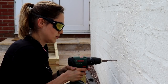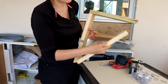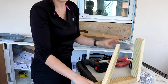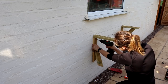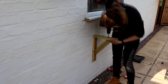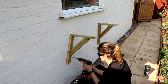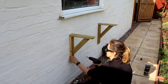I drilled minus the thickness of the bracket so I didn't go too deep. Once those two holes were done, I returned to the bracket and fixed the middle support into place using one screw on the longest side from behind. That way I could rotate it out and use a Torx head screw bit to fix the top spec screw in place, then screw it from the top with two stainless steel screws. I fixed the bottom spec screw and used a spirit level to make sure the supports were level.